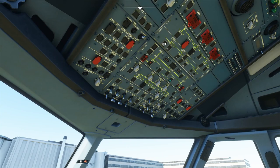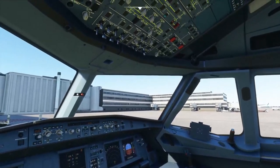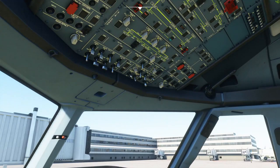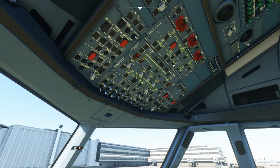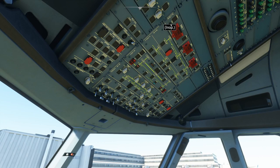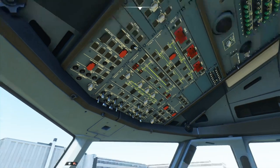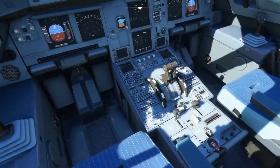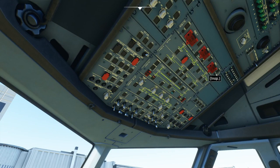For the fuel pumps, we do not engage them until the fueling process is complete. The fueler works from the fuel port over the right wing. Once fueling is complete, we turn on the seatbelt sign as a mental note that we're fueled, then turn the fuel pumps on. Moving up to the fire panel, we test engine number one's fire detection. There are seven indications for this fire test: two squibs, the fire light, the CRC, master warning, the ECAM warning, and the pedestal light. We then mirror that for engine two.